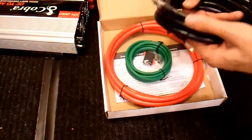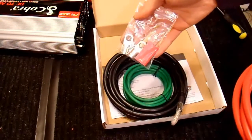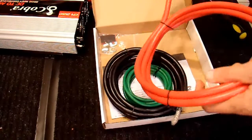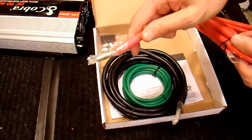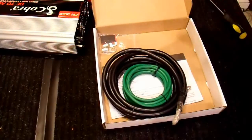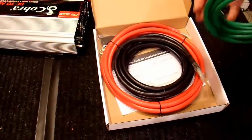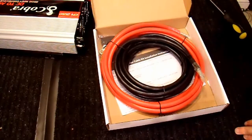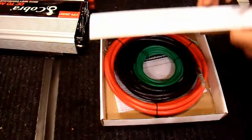I'm not going to use these kit cables, but I'll still open them up and show them to you. It's always useful to have some heavy cables sitting around for hobby purposes, so this isn't a complete waste — and these terminal rings are actually quite expensive, probably five dollars each if you bought them separately. The actual cable really seems like pretty nice stuff: it's extremely flexible, it's a very high strand count, and they tin the end so you can put it into your inverter very easily. This ground cable is 8-gauge instead of 4 and not quite as flexible, but it's adequate and actually better than I expected for what I paid.